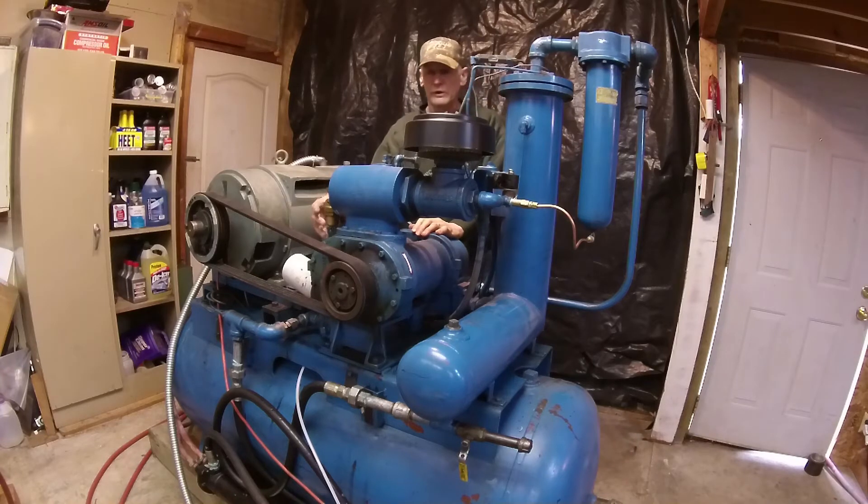When I fiddled around earlier, this valve was bent, so I took it apart and cleaned it out. Putting it back together, I got optimistic and screwed in the pressure adjustment screw a bunch of turns. I turned the thing on — it fills the tank so quickly, there's no margin of error. I'm trying to make sure nothing's leaking, nothing's going wrong, no oil pumping out somewhere, and trying to get over to my test box to balance it — and the amps shot right up to 140 amps of single-phase power. Things were overloading, so I had to cut it off. I've backed it down now to around a hundred pounds.